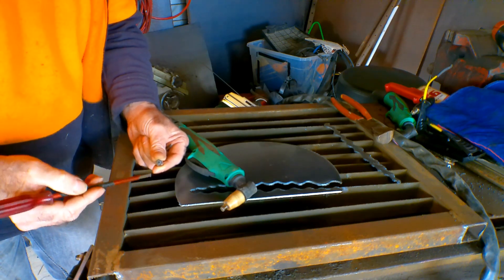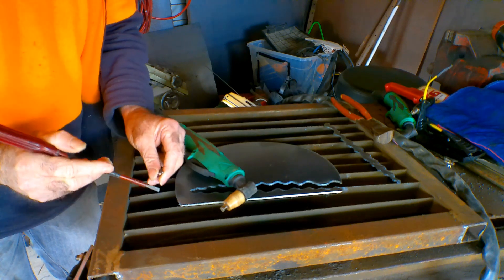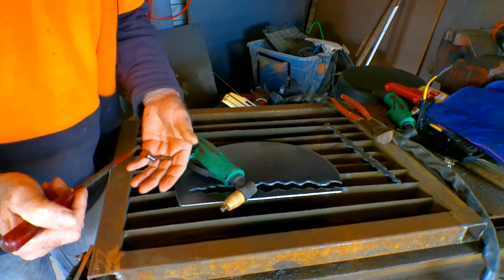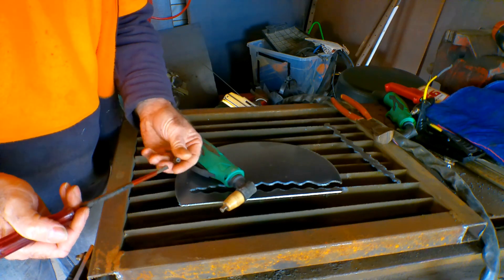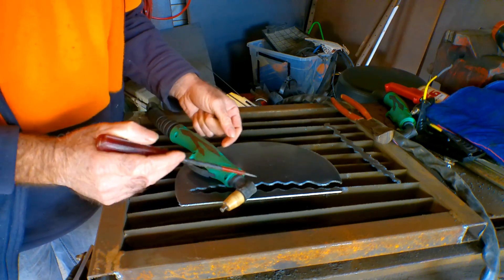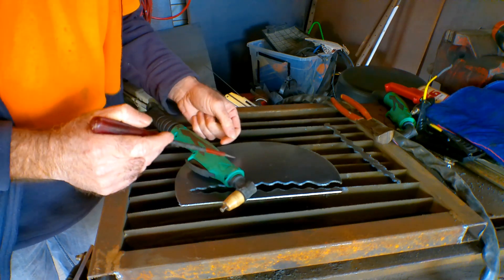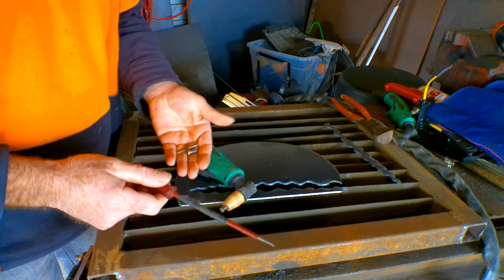Because I couldn't afford to keep replacing them, I was running consumables way past their usable life. See — it's got a humongous hole in it, and the electrode has also got a hole burnt in it. I run my plasma cutter flat out all the time, and if you put that extra stress on the machine combined with not knowing how to cut properly, next thing you know the OC light comes on.